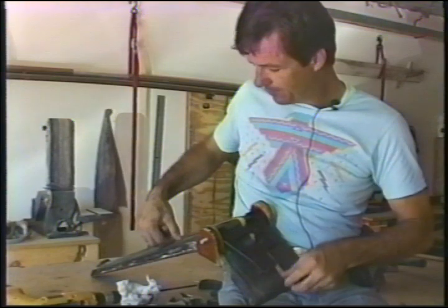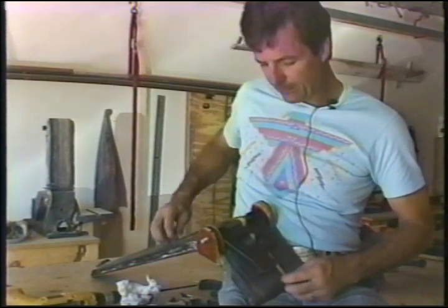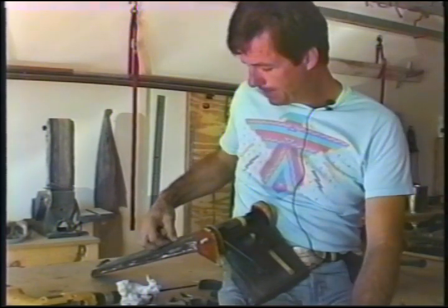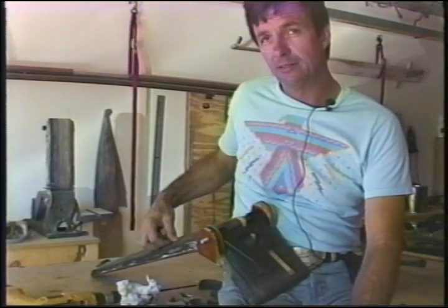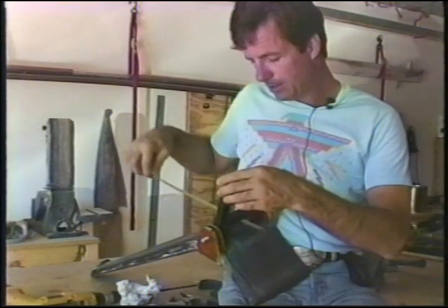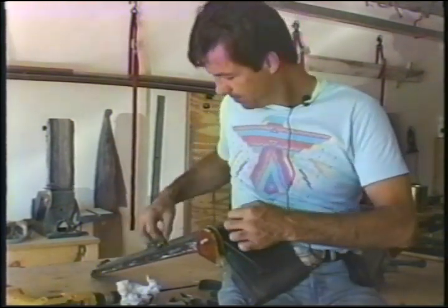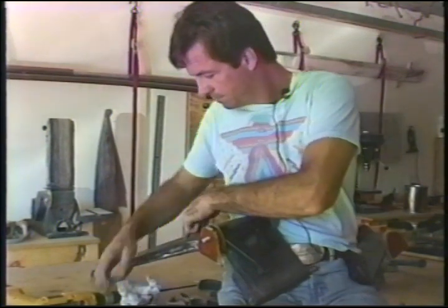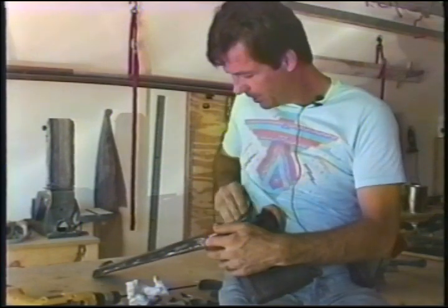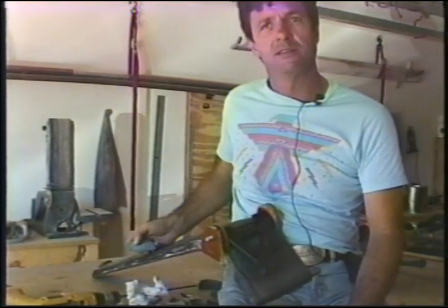So they're going to start off 17 inches in length, the first ones, and taper 1.5 inches per ply, 8 plies. I haven't got that figured out, but I'll give you that sequence in a moment or so. So again, 10 inches below, that's to here, and up to here, straight line on either side, 8 plies, 1.5 inches per ply.